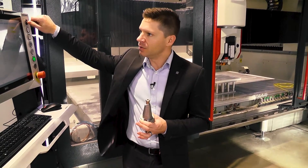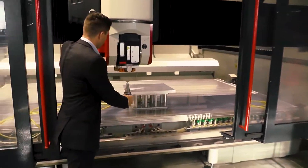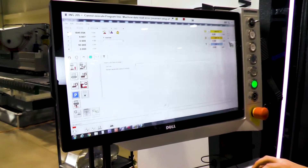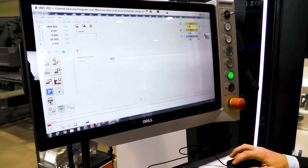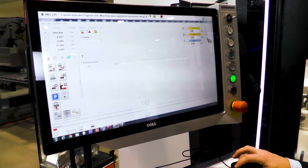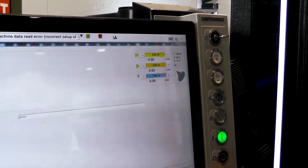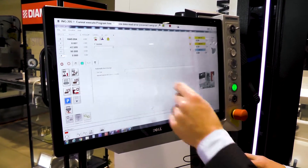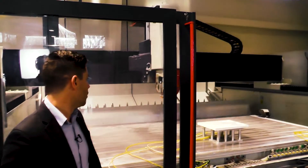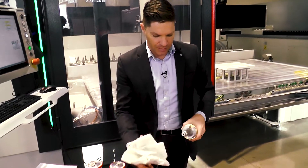Right now what we have to do is put each tool back into the machine — disabling the guard, placing one at a time. I'm going to go manually tell it exactly what tool is in. So this tool is 101 — hit OK, hit the start button, and we'll see that data come straight up here. It's going to show the diameter and the tool height. Then I'll put that tool away so I can do an automatic tool change with nothing registered, and we'll repeat that whole process one by one until all the tools are put in the proper location.